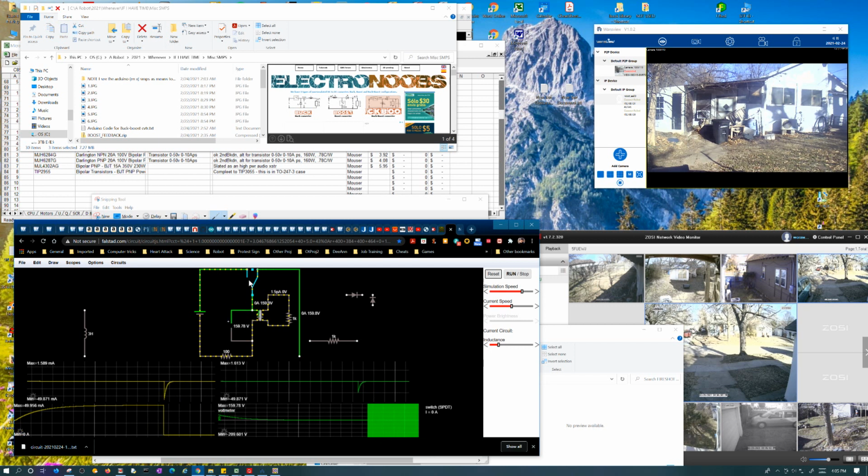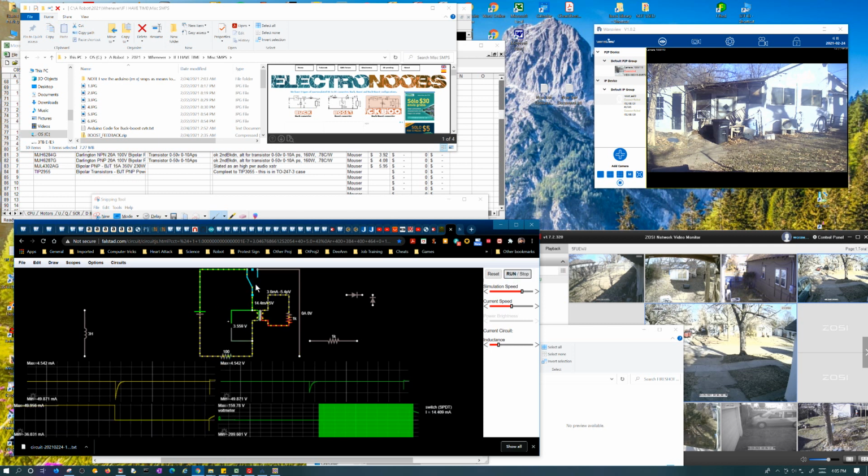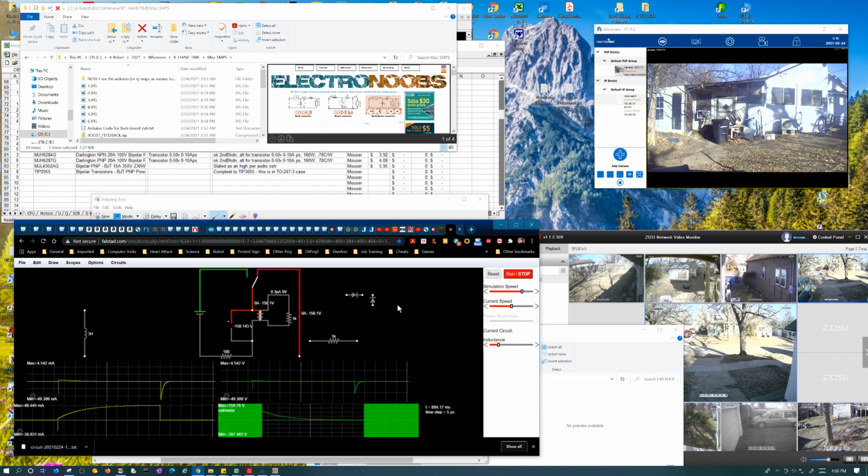So, yeah, it's still basically doing the same thing. In other words, it's still generating minus 50 volts at minus 50 milliamps, like you'd expect. It's still trying to maintain that current through a higher value resistor. But of course it takes a tenth of the time to discharge that it took to charge. So this can be kind of verified here, because it's about 10 times, so that looks about right. So that's behaving like I would expect based on what I know about inductors so far. What I don't understand is why it does that when I change the turns ratio. I know the one thing it does have going for it is that it's probably got a different inductance with a different turns ratio.